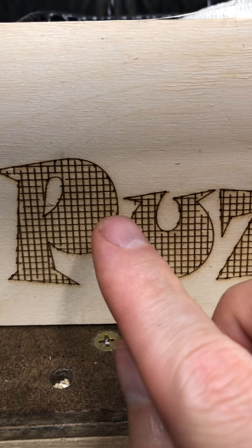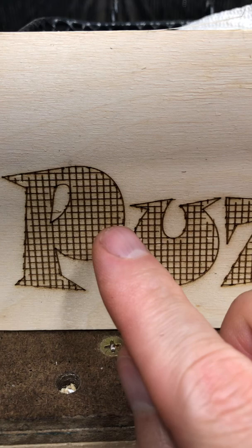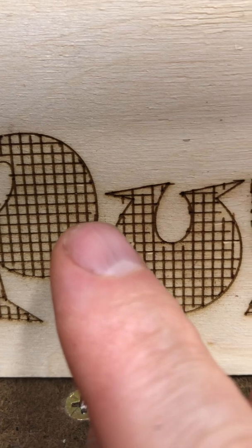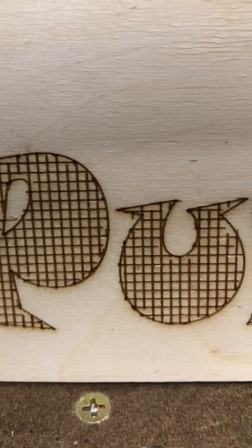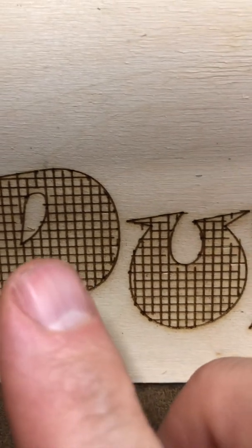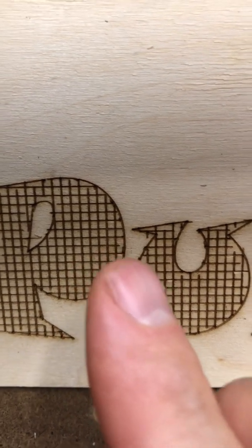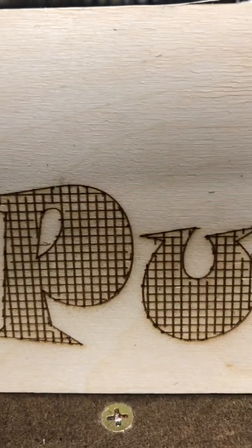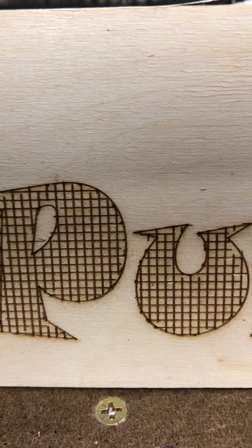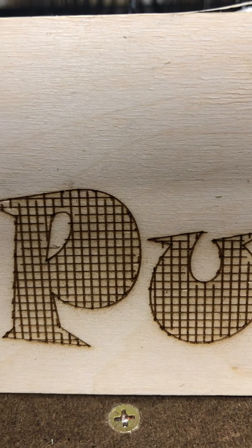For example, this little gap here — the laser went to the edge of the P after finishing a line and you see a little extra dark spot. That's a trailing spot where the laser was still on after finishing the horizontal line, and then it moved up to start the next line but the laser wasn't off yet. It hadn't actually gotten to the off mode and the motion had already started.